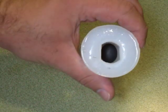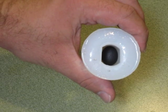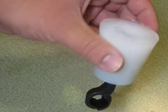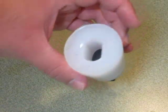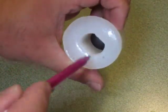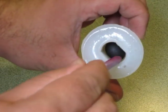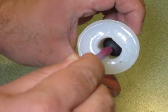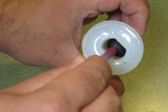Then the epoxy resin and fiberglass is going to be poured around it, leaving a bolt handle in place. Now it also is going to help me find the point at which I'm going to drill and tap for a 10-32 machine head screw, or machine screw. That's going to be the backbone of this bolt handle.